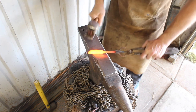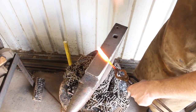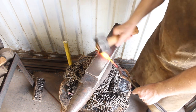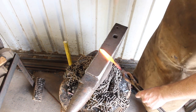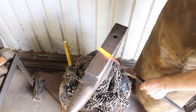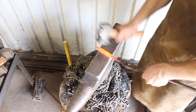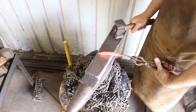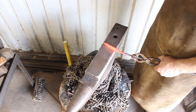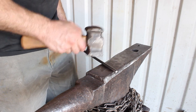One of the ways you would use this longer die area on this style of hammer is to hold your hammer at about a 45-degree angle as you're forging. This is the most efficient way to draw out material — it provides a very aggressive action on your stock because of the minimized surface area of that corner. Once you have created a series of what you would call divots or mountains in there, you can go ahead and flatten those out.